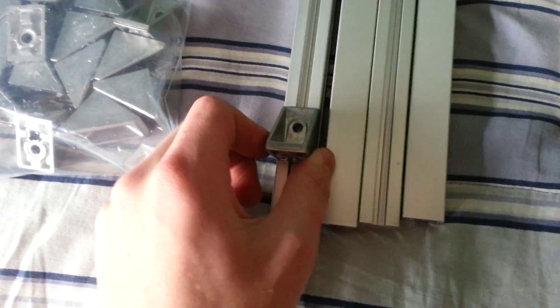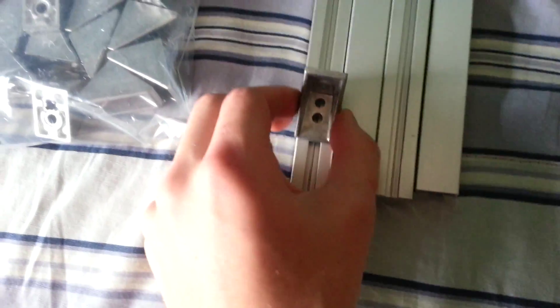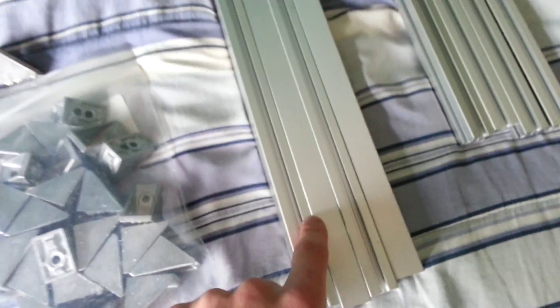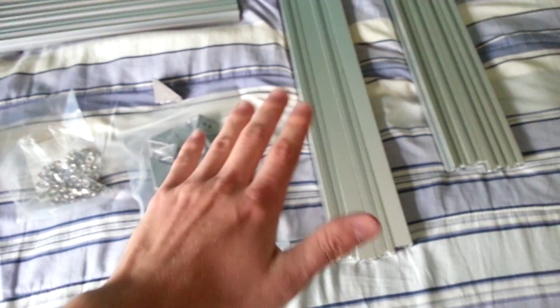Aluminum extrusion brackets here, and these also have little grooves to help you with aligning everything — grooves on both sides, although one side is better. Extrusions: I have some 3-slot extrusions 350 millimeters long, some 2-slot 400 millimeter long, and 2-slot 350 millimeter long. These 8 and these 4 are the parts of the 3 square components, and these 4 are the vertical bracket pieces.